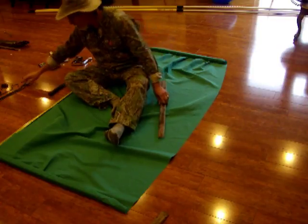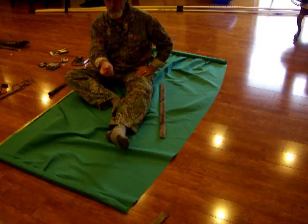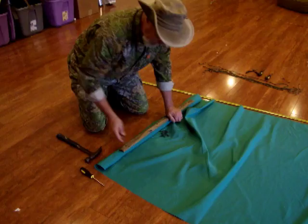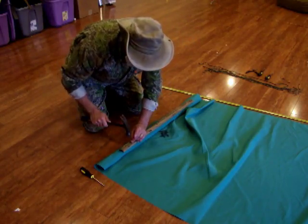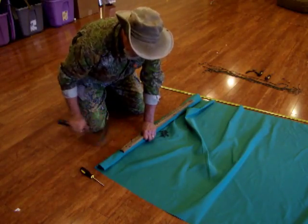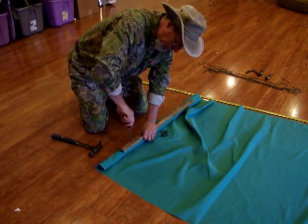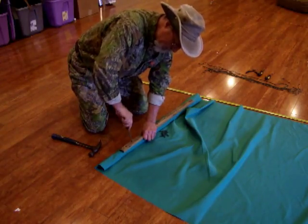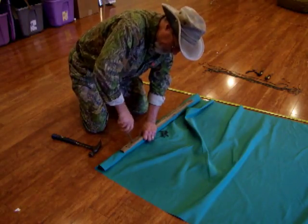So I use the wood, and I'll use some 1.25 inch screws, and I'll put these in about every 2 to 3 inches. I'm securing the 3/4 inch thick piece of wood to the 1x1 using these screws. Tap it with a hammer to get the threads to bite, and just work it in with a screwdriver. And I'm running these about every 2 inches apart.